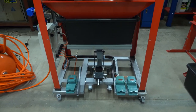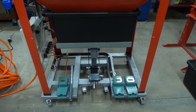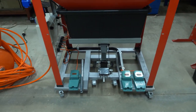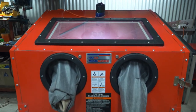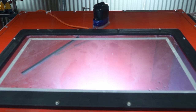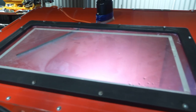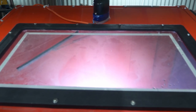Looking upwards we've got the tank system. I wanted an interchangeable tank system because I'm using two media — glass bead and aluminium oxide — so I can change these tanks out pretty quickly, just take the pump up, drop the tank, and I'm into another type of media. Above, you're going to need a windscreen wiper to keep the window clear because it does get messy in there. You're also going to need a good light — the light that comes with the cabinet is pretty poor, so I put in a waterproof LED light to give me plenty of light.